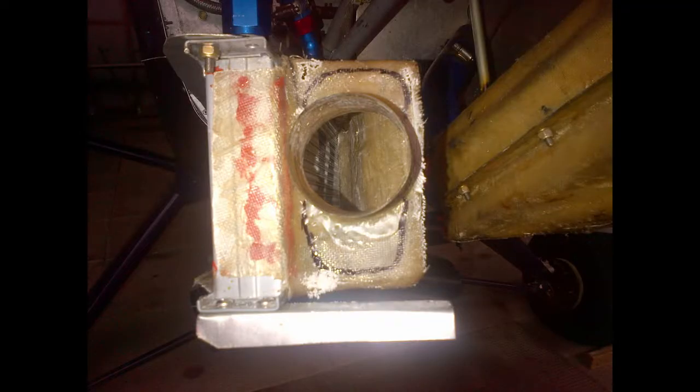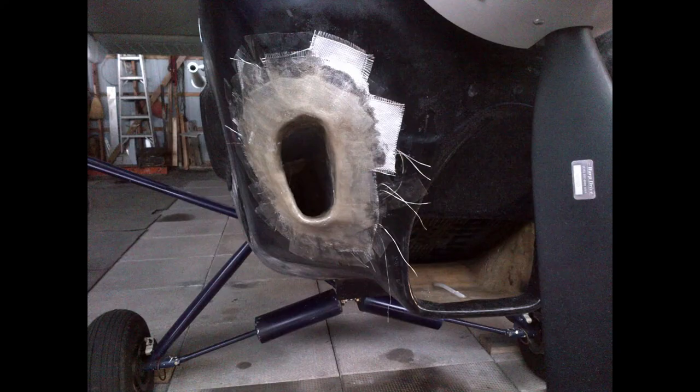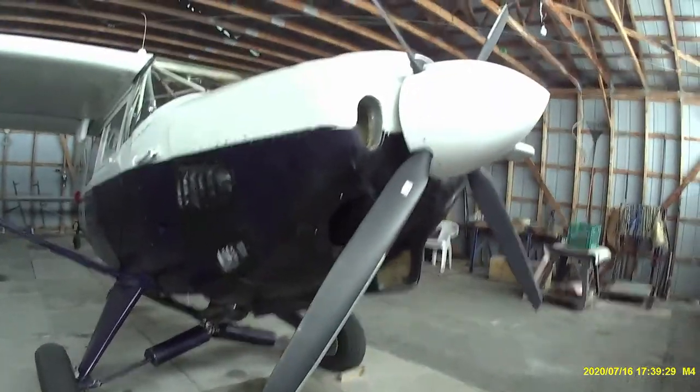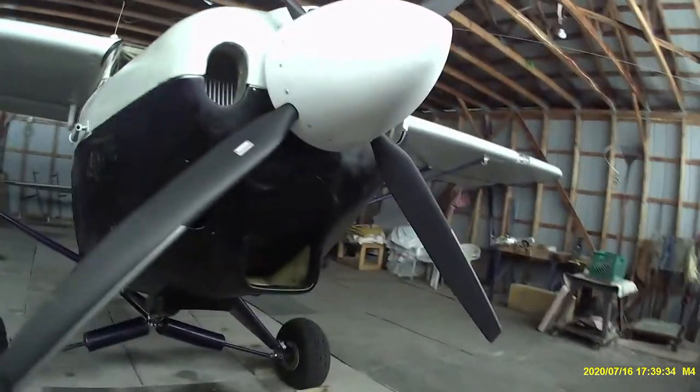To do that, looking at the original heater core inlet here — two and a half inches — we cut away the whole front face and created an opening of approximately four and a half by two and a half. We made a matching aluminum plenum, brought that forward to the front of the cowling, and glassed that in. It is now in its final configuration that I'm going to go with for all the setups with the louvers, air intake changes, etc., to make this baby cool.